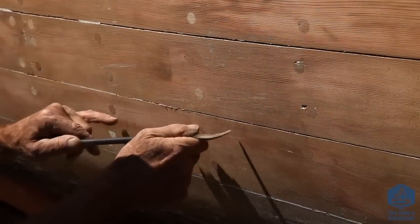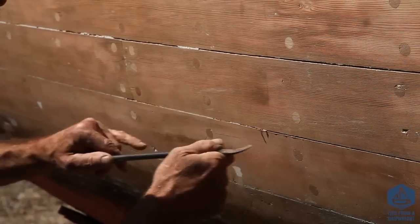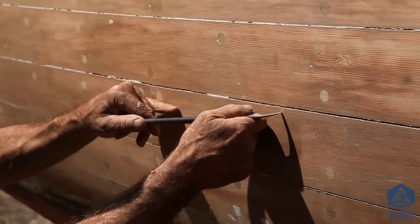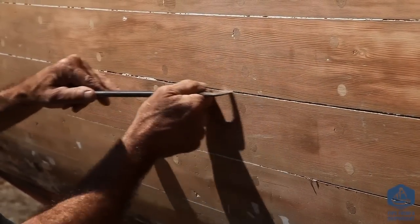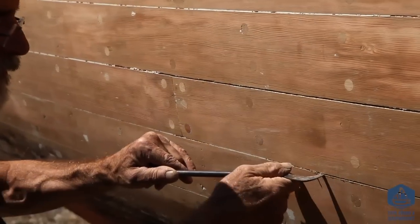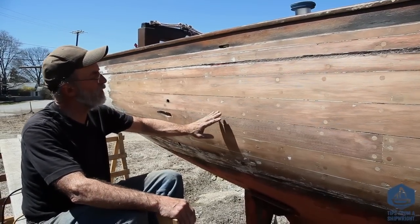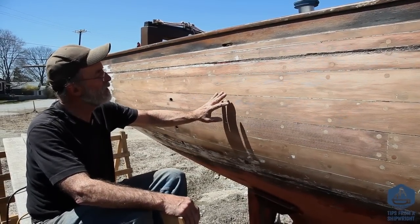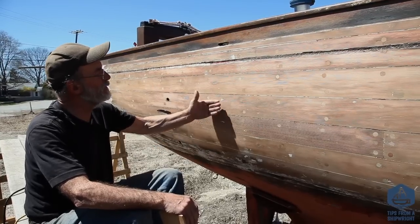This is just a little hook made out of a piece of 3/8-inch cold-rolled steel, and there are a few tricks to it. As you pull along, you don't want to pull out of the seam and then go down alongside of it — so as you pull out, you pull away from the hull like that. That way you don't have any chance of wrecking the seam. The reason I've done that is because the seam compound is actually quite a bit harder than the fir plank itself, so when you board it you end up having the seams high again.